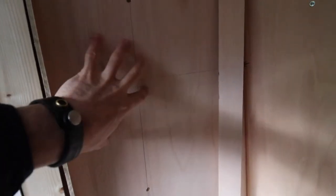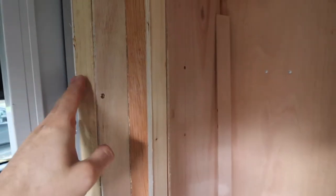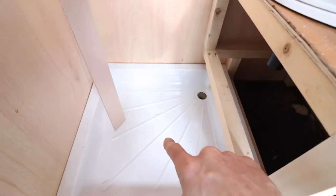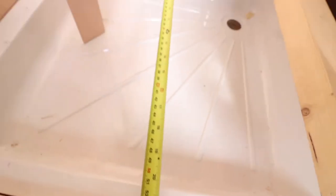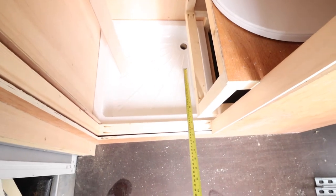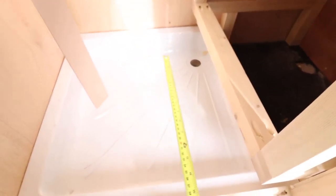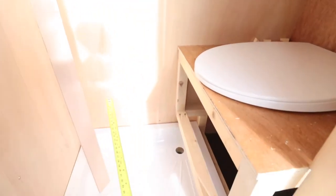The back walls have been lined with marine ply — I think it's 5mm marine ply on the back walls and on the end wall. That marine ply comes out to here and I secured it to the studding against the bulkhead. I then constructed the frame up here first, so everything was built around the shower tray dimensions: 600mm by 588mm.